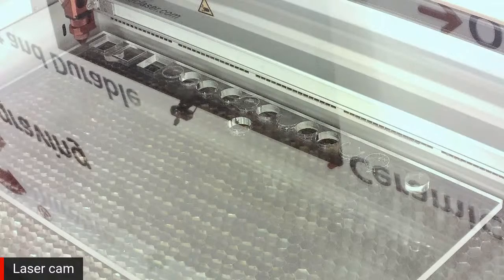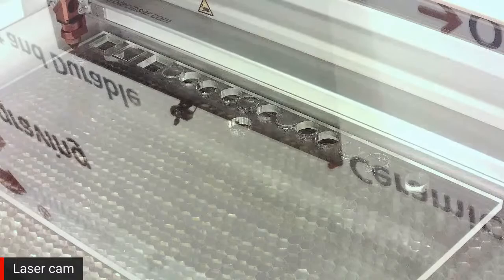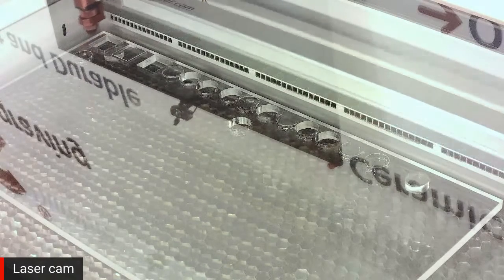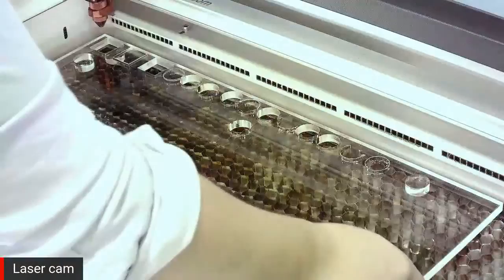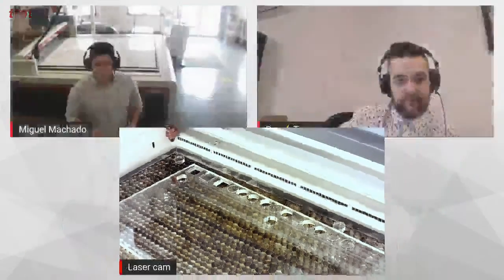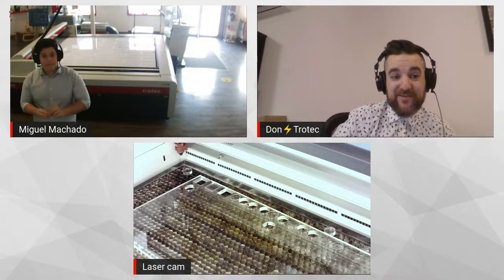Okay. Suspense, man. Yeah, it's just Ruby. So try now, Control 14. Oh yeah, that's why. Okay, so now I'm doing 2% speed. And no flare-ups, but I can see the smoke, right? I can see the gas building up. But no flare-ups, no anything. It was beautiful. It was perfect. That's the correct setting, and it cut through entirely, right? And you had purposely turned down the speed in order to solicit some extra flare-ups. Yeah, and here I can see some striations. Has a pop explosion for acrylic lifted up the whole sheet, the whole job? That does happen. It's scary as heck too when you get one of those pops.